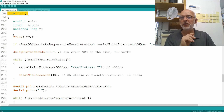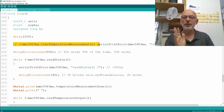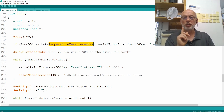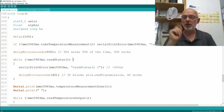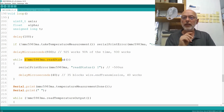In the loop, we still have a delay of 100 milliseconds, so we do something every 100 milliseconds. Then I still take a temperature measurement. That's the timing I worked out by experimenting: a delay of 930 microseconds — that's the time the chip needs to complete a temperature measurement. That's also not documented in the datasheet, but now you know it: 930 microseconds.